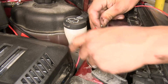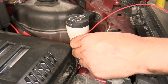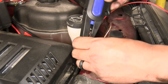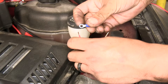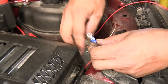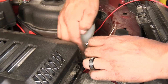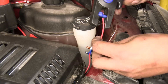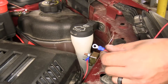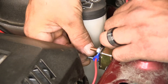We'll take our wire and give ourselves a little bit of slack just in case you need to make any adjustments or tie anything up. We'll come to the copper post, cut our wire, and make sure you hold onto that excess piece. We'll strip back the end and take one of the small ring terminals in our kit and crimp it onto the wire. Since this is coming from the plug on the front, we'll take the nut off the copper post, slide the terminal on, and replace the nut. For the excess wire, strip it back, crimp on another small ring terminal, and that one goes on the silver post on the other side of the breaker.